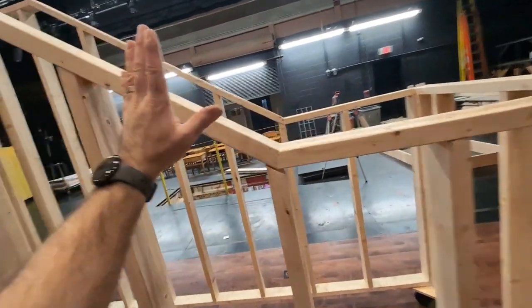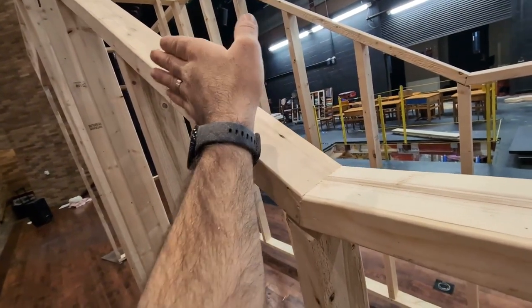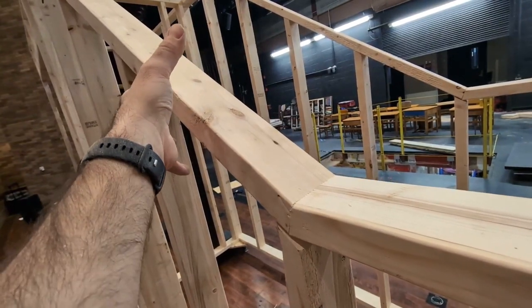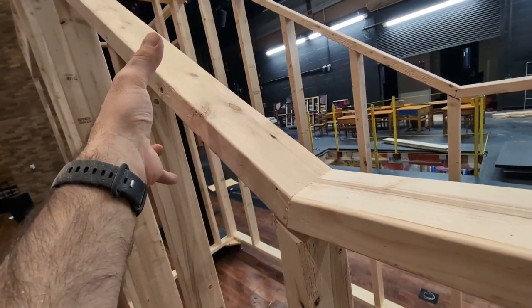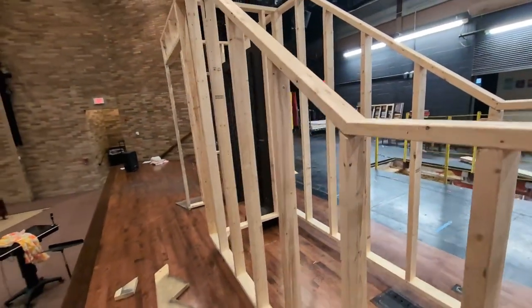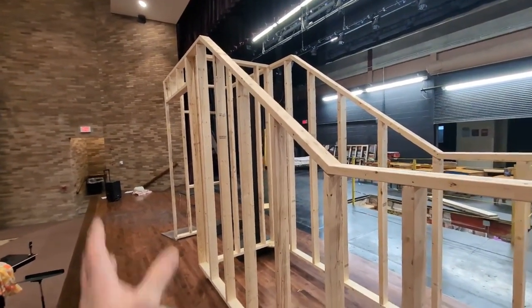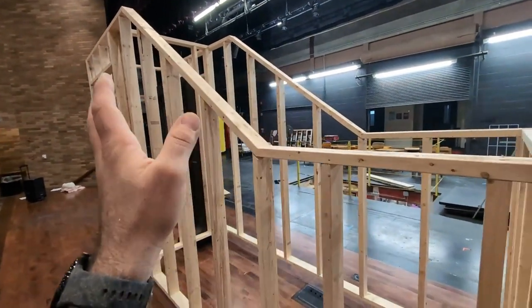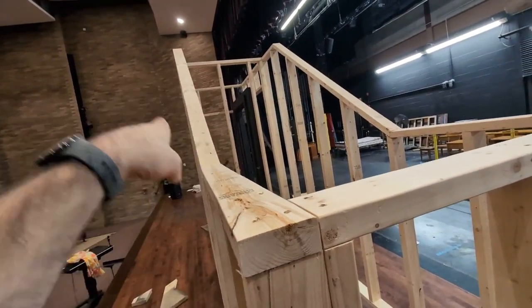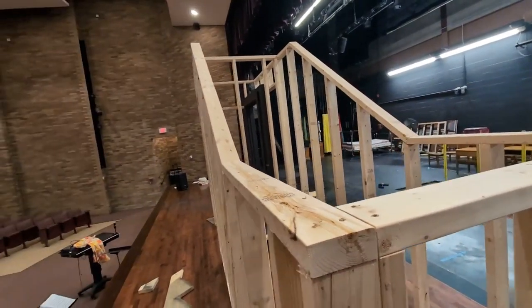Because I think when I did Adams, the stringer didn't sit flush with the framing and the luan. I think it overhung by a little bit, and then the tread overhung the stringer itself, because normally the finished stringer exposed on a staircase is a little proud of the drywall, and you want to have those types of things correct so you get the right shadow lines and things don't look weird. And so you've got nominal dimensions, you know, this is 4 feet wide, but you've got to be sure that you can put the 1/4 inch of luan on that and then have the stringer not sit behind the luan, which you don't want, the top edge of the luan to catch light and then have the stringer start. You want the stringer to overhang it. And then you want the nose of the stairs to overhang that.